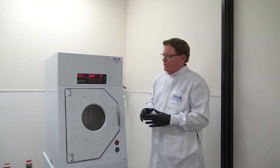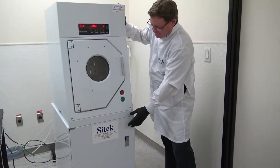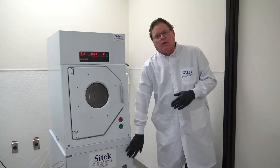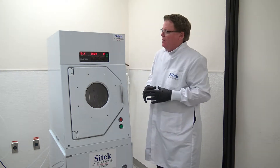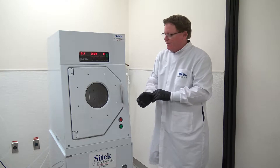It is set up to be 220V ready because it is going international. The system is a 4300F because if you buy the system by itself on a tabletop it's a 2300F; when you add the base it makes the system a 4300F. The customer's purchase order actually says 2300F with an optional line item for the base. We call it a 4300F because that's the real configuration. It also has the PSC-101 digital controller, already set up for 220V.